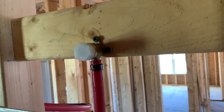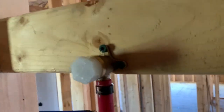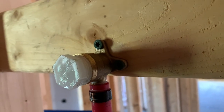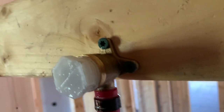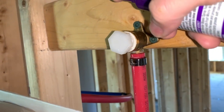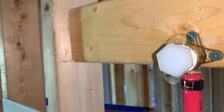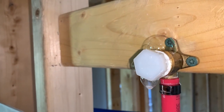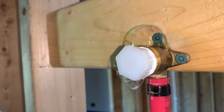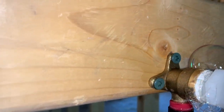If you're going around spraying all the joints, look for air bubbles coming up after you spray it. So I'm going to take the soapy water solution and spray on that joint — and look at that. You couldn't hear any air hissing or anything like that, but spray a little soapy water on it and it's quite obvious.